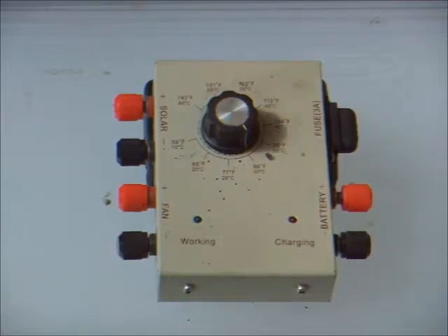The battery was optional and not included. The battery output seemed to be a rudimentary PWM type charge controller. I found a few issues with this controller. One is there are no adjustments for battery type, float voltage, etc. Another is that the fan output is pulse width modulated to around a 50% duty cycle, which makes the fan run slow. I suspect this was done to allow the two small solar panels to charge the battery, as the fan would otherwise draw about as much current as the panels' output.